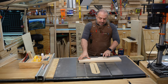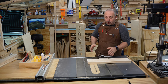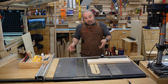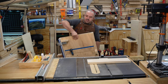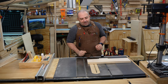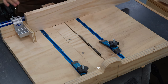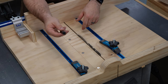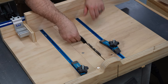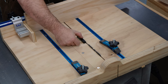You should utilize your miter gauge, which typically comes with every table saw — it allows you to move the wood through the blade at a perpendicular line without binding. You can also use a crosscut sled, which is what I'm going to use. Both are great options. Do it the safe way; don't use your fence for this. The material I'm using is one inch thick, so I'm setting the blade to half that thickness — one half inch. I'll place a setup block at the saw, move it down until I'm just kissing the top, and we're ready to rock.